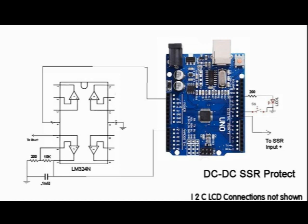This is what is new today: my solution to protecting the DC-to-DC SSR from unintentional overcurrent spikes that I cause when sticking too much work into the work coil, usually ferrous metal of some sort. It's basically an Arduino Uno that reads the voltage drop across the existing 75 millivolt shunt that also connects to the analog ammeter, which is my major load indicator. The actual shunt voltage is amplified about 50 times by one leg of an LM324 op amp.